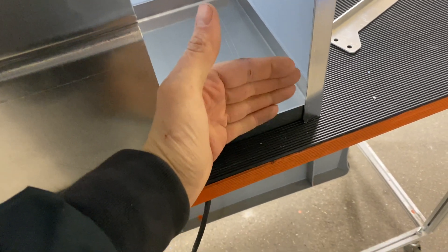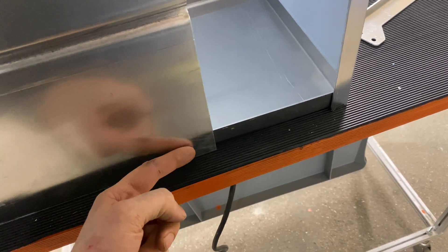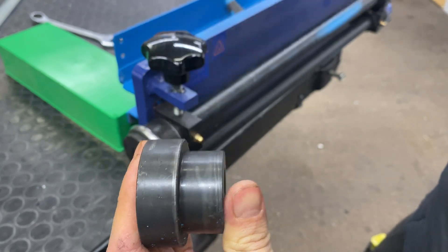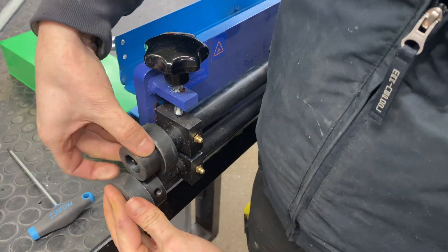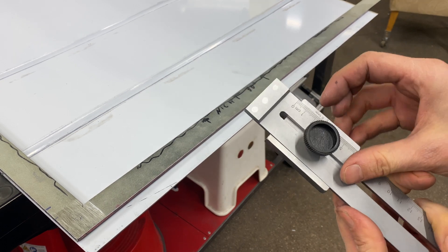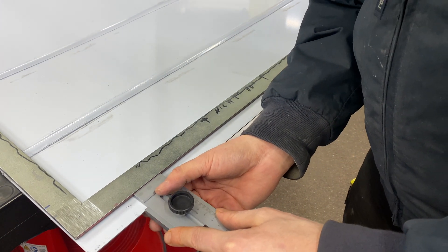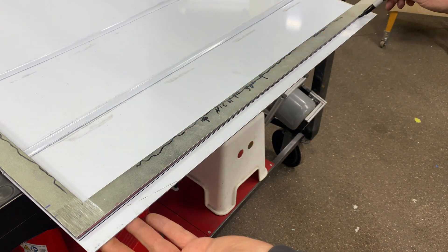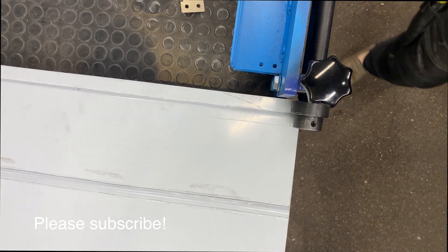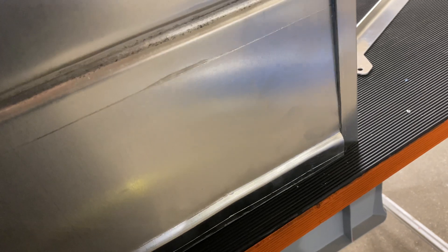This panel will go on the inside so we don't add any more thickness since we're a bit close here. But if it's on the inside it will butt up to this piece and I want it to overlap onto this piece. So what we're going to do is make a flange so we step out and go down here - I think these are the right dies for that. I've got this new adjustable marking tool - you can lock it down and then it's really easy to butt it up against edges and line things up. The result is beautiful - obviously it's not perfectly straight but I can live with it.